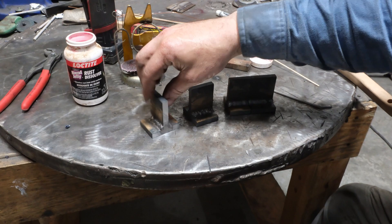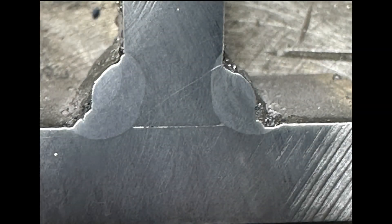I have both samples cut and etched. Looking at the vertical up weld — high five for some undercut, oh well — we have good sidewall fusion and good root fusion. This is going to be typical of what you find with 6010 vertical up. Had I run a little more amperage with less dig, it might be slightly better. Now let's contrast that to the vertical down weld — it basically lost all fusion. It doesn't even look like the same rod was run.